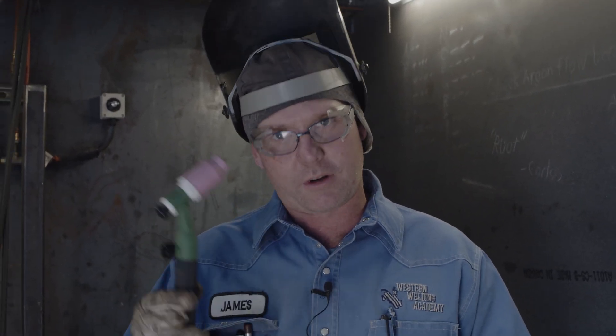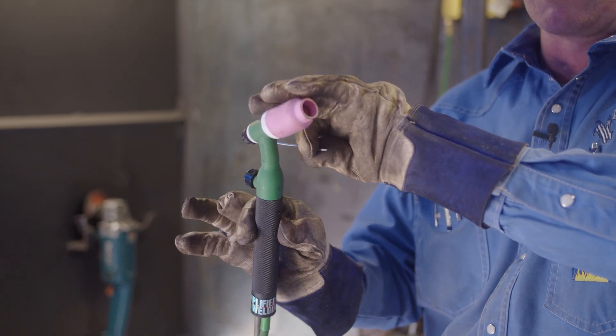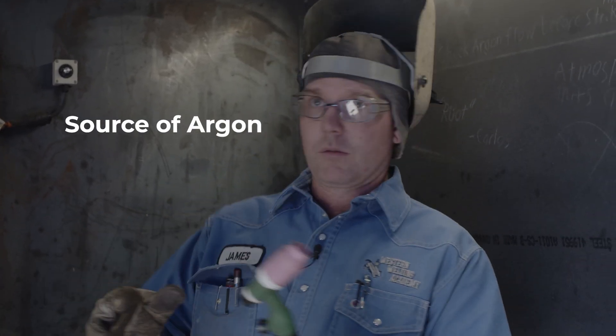The common tools you're going to need for TIG welding, of course, is a TIG torch. I like to use these Amplified Big Green Hulk TIG torches. You aren't going to need a 300 amp like this one here — you probably need a 150 or 100 amp for what you're doing around the house. This is for heavy-duty production welding. You need a TIG torch complete with a cup, some sort of gas distribution nozzle, and a diffuser. You also need a source of argon — we've got a big tank here, but you can get a high-pressure tank that looks like an oxygen bottle.